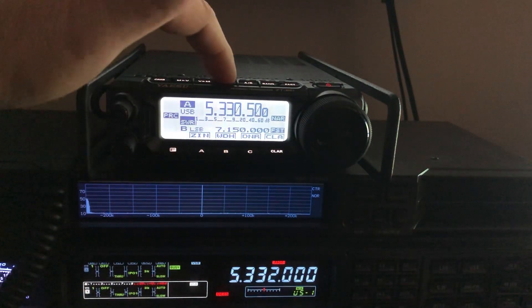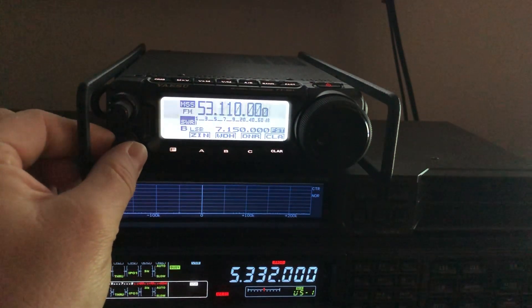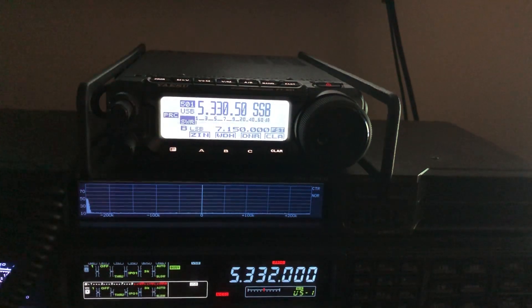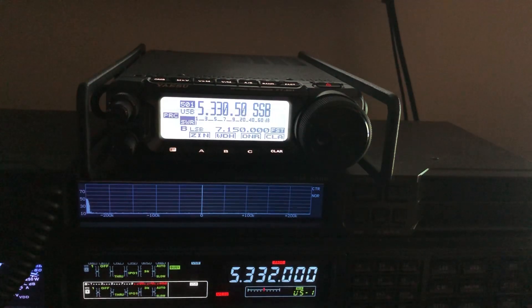I'm going to tap it. It changes to 501. That 501 starts the 60 meter band — they're pre-programmed memories in the radio. If you've never gone into the memory mode of your radio, you wouldn't have seen it. But watch what happens now when I transmit: solid red light. The 60 meter channels work there.